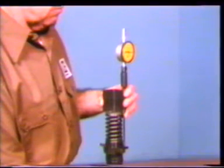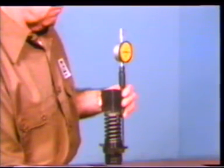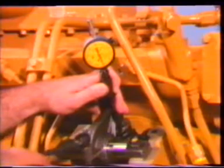There is a different setting for reduced RPM engines. The dial indicator determines if the distance from the top of the injector follower to the injector body surface is correct. The dial indicator is held by a collet that is part of the timing fixture.